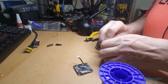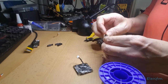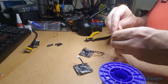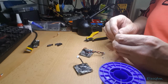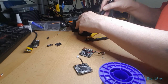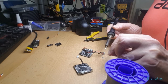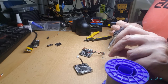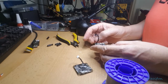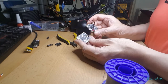But yeah, so these little things don't have to take that long. It's nice to have things pre-set up, but that's not how we all work. We don't always work like that. So I'm just gonna put my soldering iron on to 200 degrees so it can just sit there and stay warm, but not too warm that it's heating my tip too much. Put a little tiny bit of solder on it just to keep that flux going, keep it nice and ready to be used. So let's have a look. Yeah, like I say, I probably want to cut these down a little bit, and I also want to, if I just compare them side by side, look.